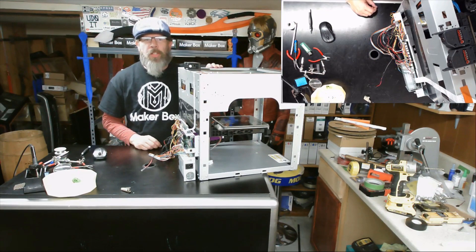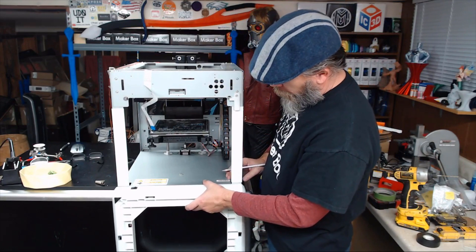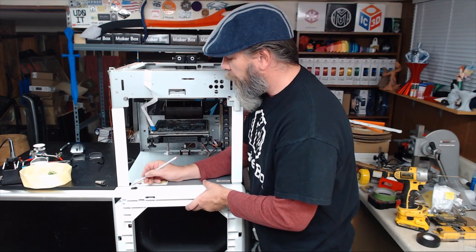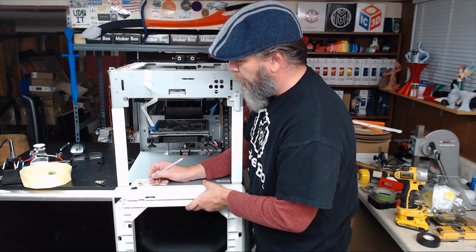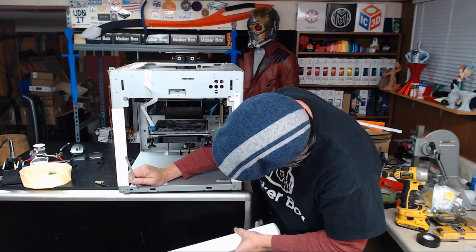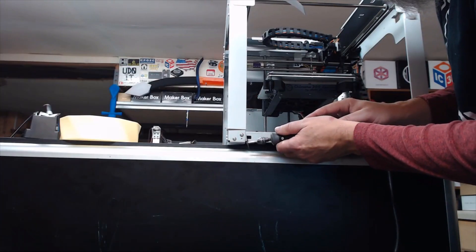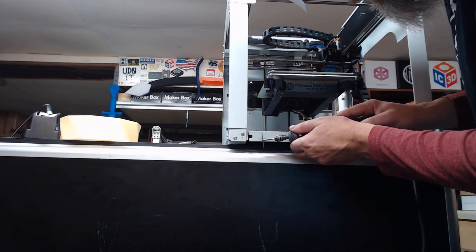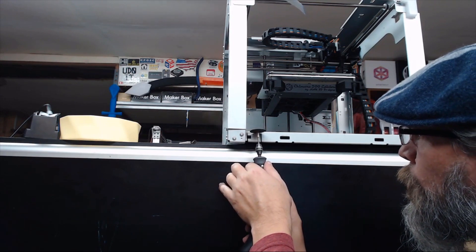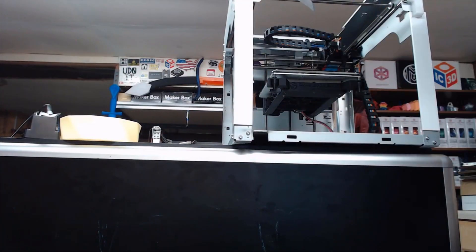All we have left to do now is trim the front of this chassis where the switch is going to go. We're going to line up our tray so the corners of the front basically line up with the corners of your uprights. We're just going to make some light marks on either side of the switch so we know we're going to clear. Then we're going to come about an eighth of an inch down across the front and trim all this out so that our switch can go through. And now we have our cutout.